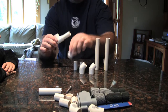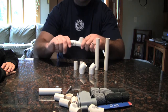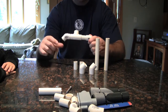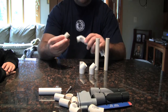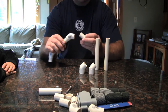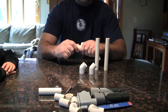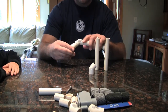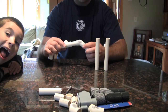One of the 45s on one side, one of the 45s on the other side. Once we've got that done we'll just adjust them a little bit to where we like it. Then we're going to attach two nipples to each of those 45s. Now we're dry fitting everything. You don't want to put any PVC cement on it yet. Just dry fit it and see where you want it and then you can go back through and mark it and set it. Put another 45 on and the other 45 on the other side.